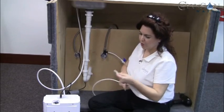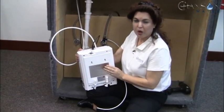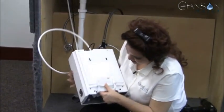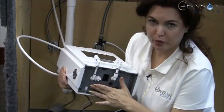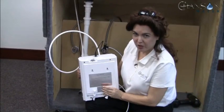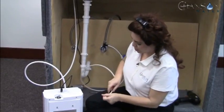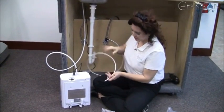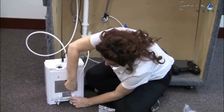This piece will go straight to the back of your ionizer. We have our inlet tube for water going into the ionizer on the right, and the outlet on the left — it does tell you that on the bottom of the ionizer. On this ionizer, the inlet valve is on the right and the out water is on the left. We're going to push the end of this tube — we're taking water from the cold water line and taking it straight into the inlet tube by pushing firmly and pulling back to test that connection.